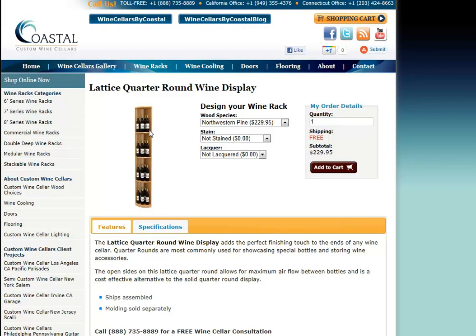As is true with all of our wine racks — the displays, the arches, the half racks, the tasting tables, and the quarter-round display shelves — they have the three-and-three-quarter-inch openings for the single-bottle storage racks on the tasting tables. They all rest on an inch-and-a-half toe kick or base that elevates everything up off the floor, as you can see here at the bottom. We use dado-cut horizontal front spacer bars, which make installation much easier and allow a much nicer furniture-quality appearance.